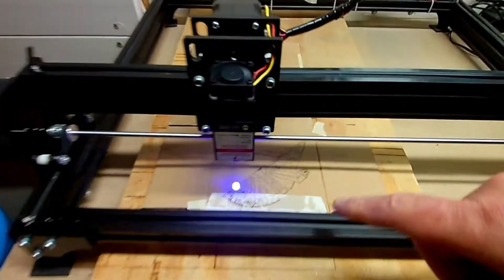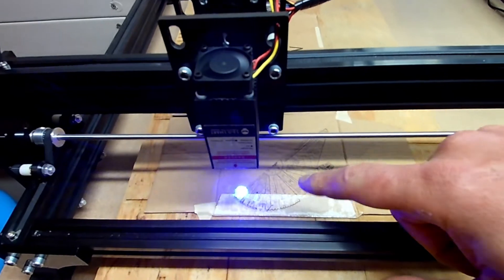So what I did was I made a modification in the LightBurn software so that when the laser is not cutting, it does not do the quick move. What it was doing was cutting at say 500 to 600 millimeters per minute, and then when the laser turned off, it cranked all the way up to 10,000 millimeters per minute. That made the burns run quickly, but I've been running into those wobbly, wiggly, jagged issues. And that's just another thing to try — it seems to have helped a little bit.